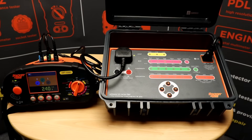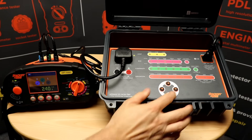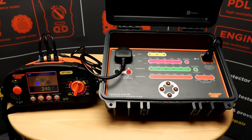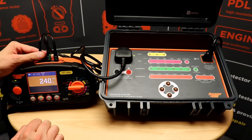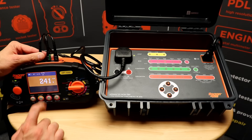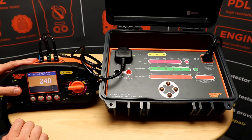I'm now going to use the CB400 to check the accuracy of the MFT 5000 30 milliamp auto test on the CB400. I've selected 30 milliamps times one half. I'll then select 30 milliamps auto, ensure we're on type AC and start the test.